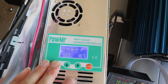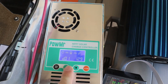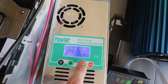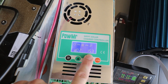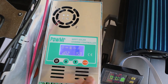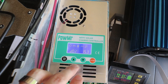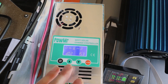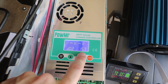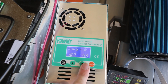This is just after it booted up. If I hit the program button, we've got D01, which is apparently how many hours a day that it runs — we're going to ignore that for lithium-ion. D02: this number is your maximum voltage when you're set to lithium-ion charging. It has auto-detection to determine whether this is a 12, 24, 36, or 48-volt system. So if it's anywhere above 44 volts, it's going to assume a 48-volt system, which means times 4. So 15.3 times 4 is about 61 volts — that's what I've got my lithium-ion batteries set to for a 15S, which is about 4.1 volts per cell.